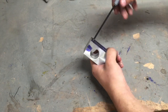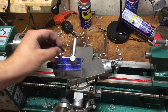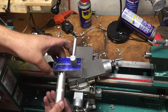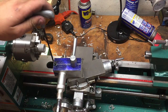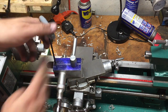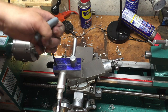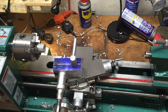All right, see if it works. I've got this piece of seven-thousandths shim stock in here because this handpiece is actually about 0.990 inches or so. All right, that's solid — so chuck up a tool in our new active tool post.